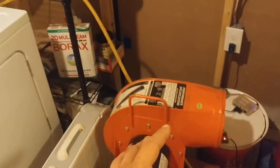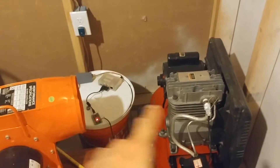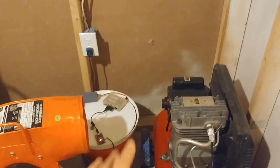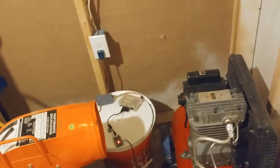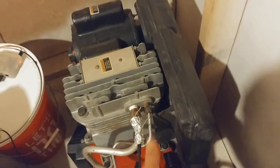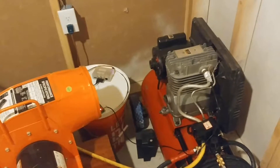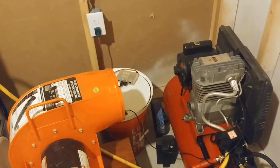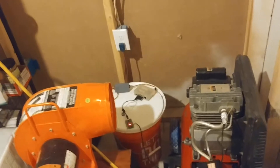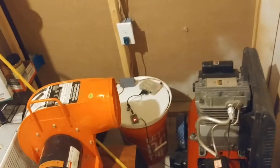For the big blower rated at 1,390 SCFM, that one leveled off at 210°F — it took a few minutes to get there, and at about the three-minute mark it was at 200°F. Over the next three minutes it only went up 10 more degrees and then just stayed at 210°F. I don't know the ideal temperature range for this thing, but 210°F sounds pretty good — it definitely sounds better than 300°F plus. So I think I'm going to go with this one. I do have some mild concerns about cooling from only one side, since that differentially cools the air compressor head and might cause funny expansion in the material. But then again, the built-in fan on the pulley is also only cooling from one side, and that's supposedly okay.